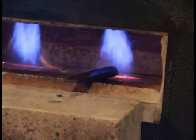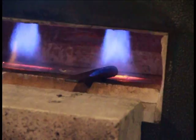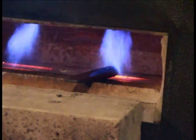One point of interest is that we use this tool as a hot cut or a hot chisel, which means that we're not particularly worried about the actual temper of the cutting edge — otherwise we would have to do this in a slightly different way in order to soften the head while keeping the cutting edge nice and hard.